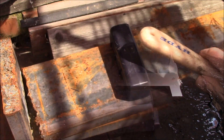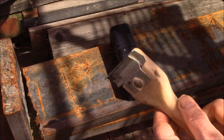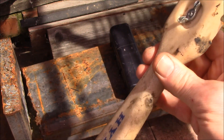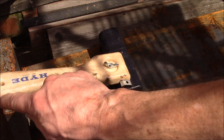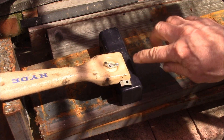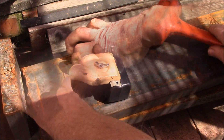Here's where I crack these open. I've seen videos using a four-sided scraper blade, but I have a two-sided blade - you can see it only sticks out a little so it can't go in very far. I have a piece of steel to support the handle end, then I line the blade up on the crack with the smooth side up and give it a pop.